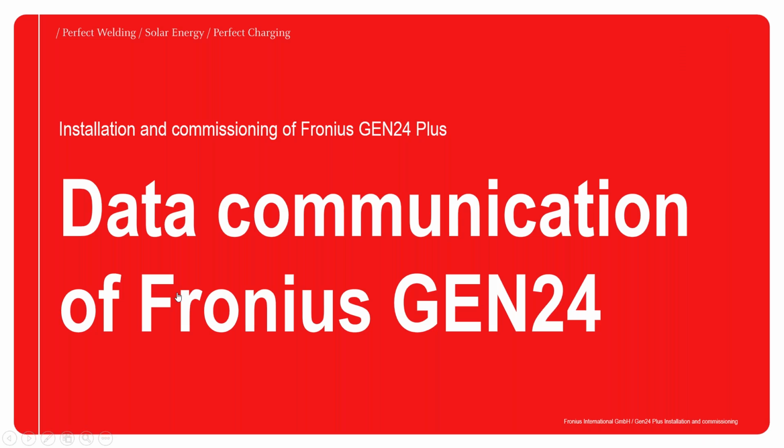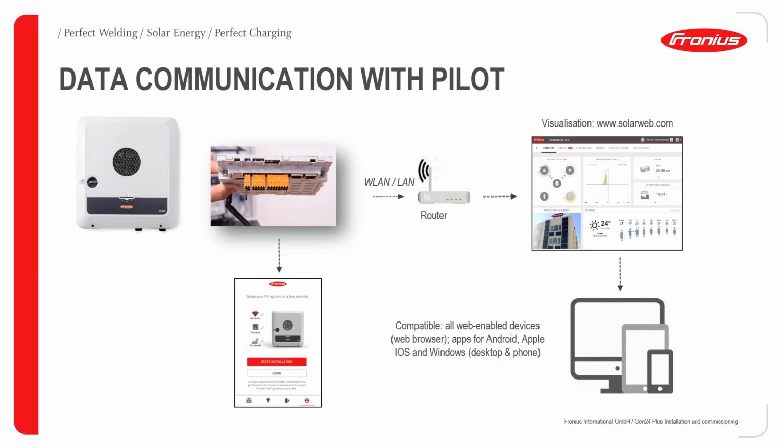So that's it about the installation. The next section we'll be going to is the data communication of the Fronius GEN24. Like I told you earlier, the Pilot is what we use for the data communication for GEN24 Plus inverters. So upon connection, the installation, this makes the Pilot active, and then via the router, you can visualize the activity of your inverter via SolarWeb. This can be done, of course, on web-enabled devices like your PCs, tablets, smartphones, and even smart watches.